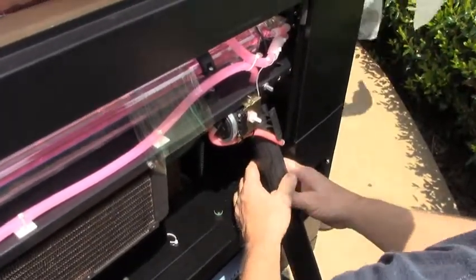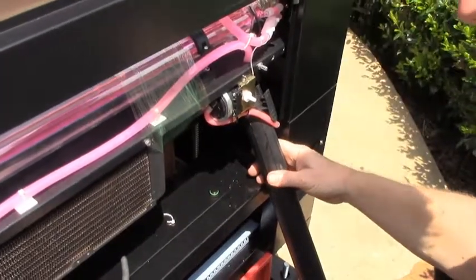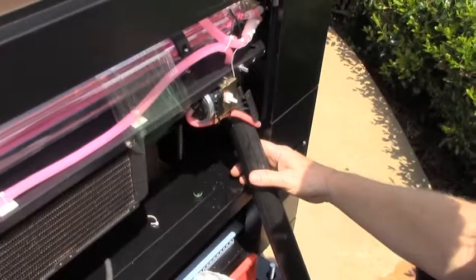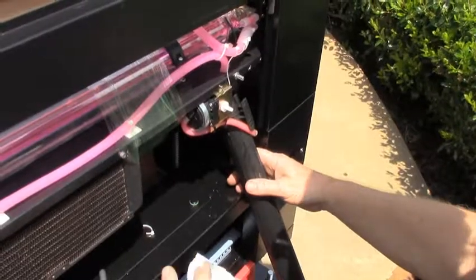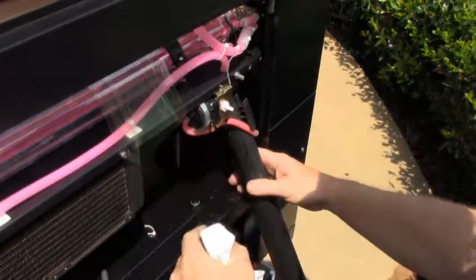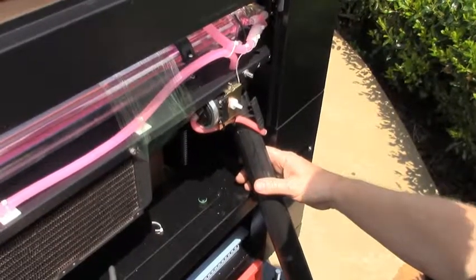I'm going to pull a little bit of vacuum on it. Never put pressure — if this is on video, never put pressure on this tube. You are creating a bomb if you do. Under vacuum, this can handle perfect vacuum because the glass is incredibly strong under compression. If you pull a vacuum, only the outside air is going to squeeze it, and it will squeeze it uniformly. But if you put pressure on this, it will deform to the worst defect in the thing, and that's where it will crack and break.